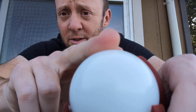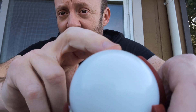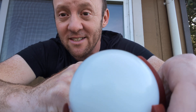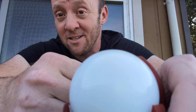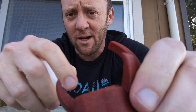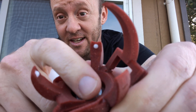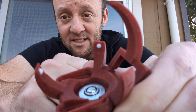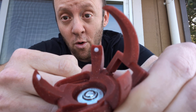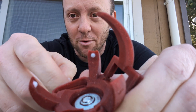So you get this incredibly low static friction of a BTU — it moves immediately as you touch it — and you also get the non-crunchiness that comes from using fewer BTUs. When you use three BTUs, there's all this crunching that happens because the BTU has a ball that rests on a bunch of other balls in a race underneath it, and when you have three of those going, they can create a lot of noise. Depending on how well-constructed they are, every single one is adding more balls rolling on balls rolling on balls — literally three stages of that.